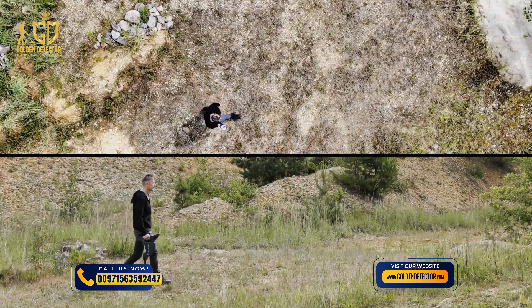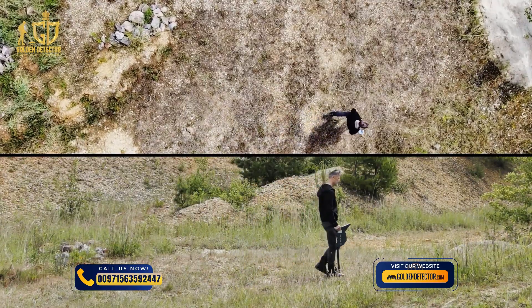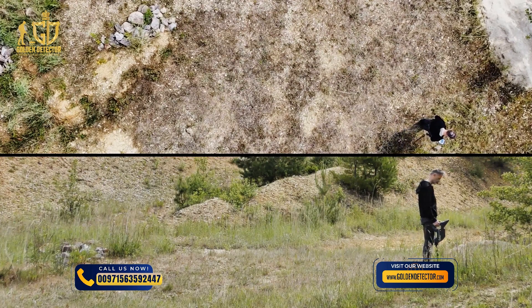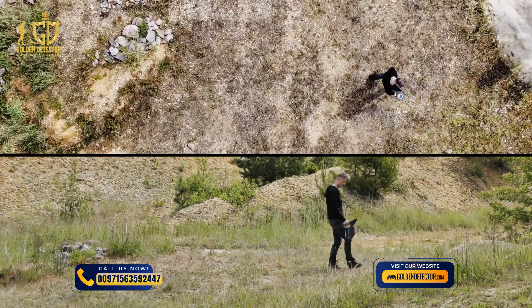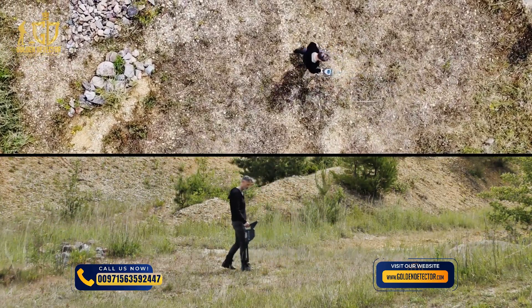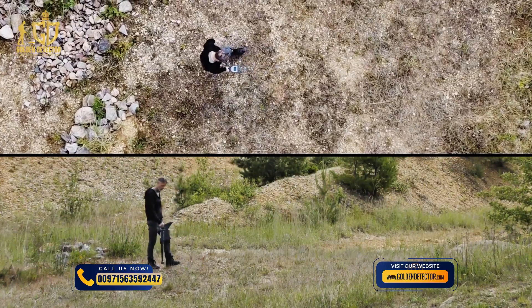Alternatively, you can walk forwards and backwards without rotating around your own axis. In this case, you don't need to rotate the probe. But keep in mind that walking backwards might affect the measurement results — it is more difficult to keep straight lines and the walking speed may be slower. If you are undecided, we recommend you use the scan mode parallel.